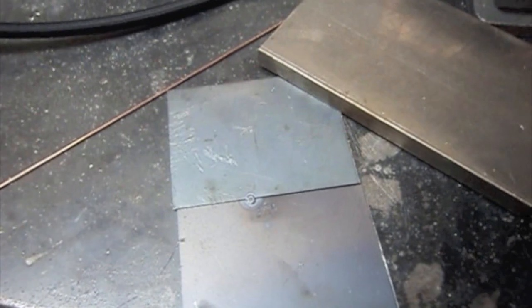Let's put on our gear and get started. Okay, here's our quick bead — let's see if we can get a good look at that. This is running around 55 amps on a piece of 1/16th inch plate. No high frequency start — this is just lift arc, a quick and dirty way to do it if you want to learn how to TIG weld and practice.